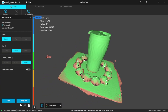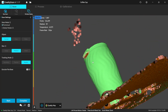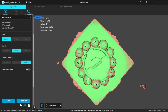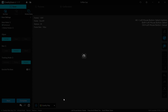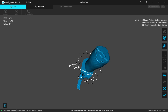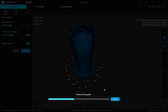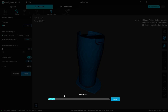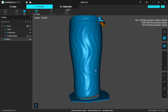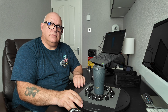Stop and have a look at this — as you can see that's scanned really well. The bottom hasn't been done yet, which would be done if we were to flip it over, but for the purpose of this video I think that'll do. Let's complete that scan, chop off the bit for that move, fuse it at 0.3, and let's mesh it. There you go — with the markers outside the coffee cup, we've been able to scan it.